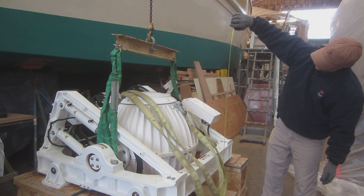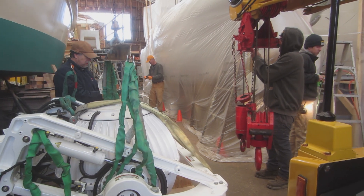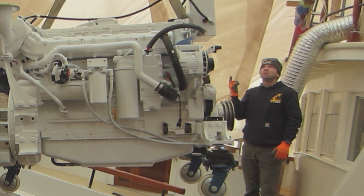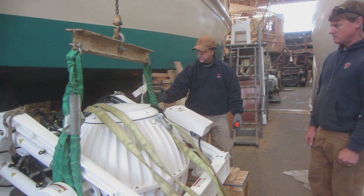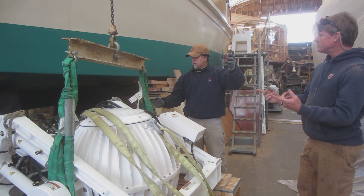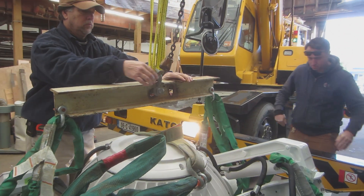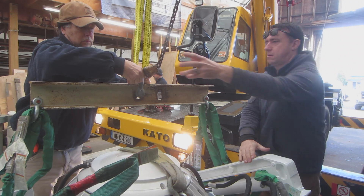We finally had the crane come in to load the gyro into the boat. The gyro weighs as much as a large engine — 3,100 pounds — so it's not insignificant. We certainly can't lift it with a forklift here in the shop, so we brought in the proper crane company — the same guys who did the tanks, the engine, and the generators. We let the straps come down, let the heavy part come through the hole, and had additional straps on the gyro to control the tilt needed to get it through the opening, plus safety lines in case anything parted — we didn't want to drop this very expensive piece of equipment.